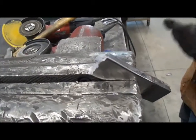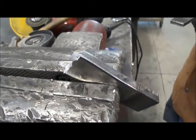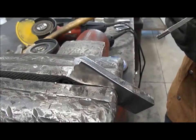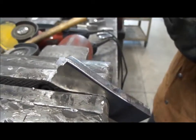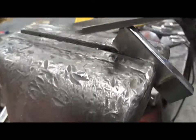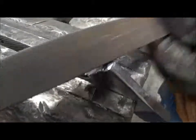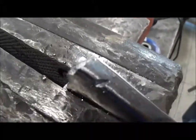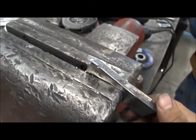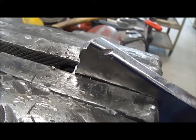This is the piece we just put through the bend tester — heated, and obviously achieved a martensitic grain structure. What we're going to show you now is that because this is A36, a low carbon steel, it is not hardened as many people think. We don't have a hardness tester — maybe we'll send this piece up to Fond du Lac — but we do have a file. You can see the file cuts very, very easily. Cut a notch right in there — that took nothing at all. If this was a high carbon hardened steel, you would not be able to do that. That's a very interesting effect of the A36 low carbon steel.